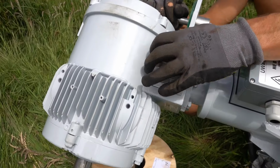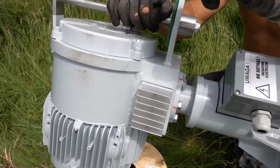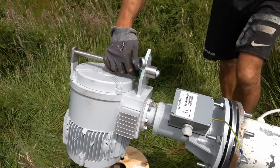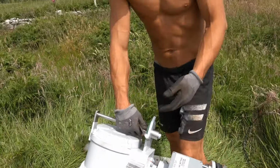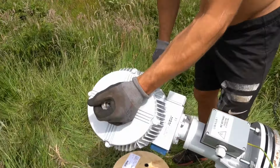Here is an extra protection thyristor inside, which shorts the generator at about 580 volts DC, which is a rectified three-phase. Shaft. Nice, no cogging. Brushes can be replaced. IP66. Beautiful machine.